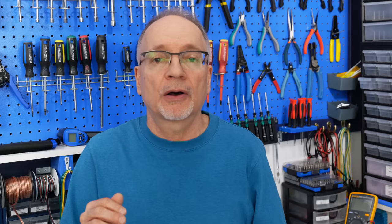The two experiments so far sent data in only one direction. Now we'll send LoRa data in both directions, using the push buttons and LEDs on each Arduino — each push button will control the other device's LED. We'll use a callback function that's activated whenever data is received, similar to an interrupt. The module's G0 pin connected to an interrupt-capable pin on the Arduino is how the library treats this callback. We'll write a function that executes every time data is received and attach it to that callback.